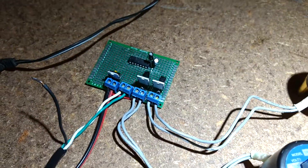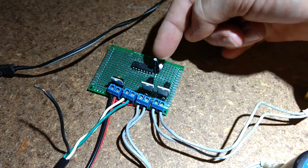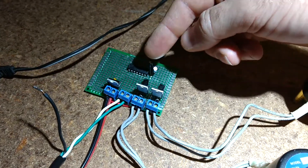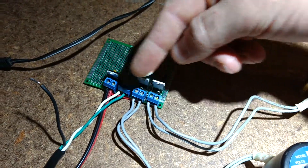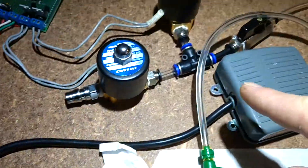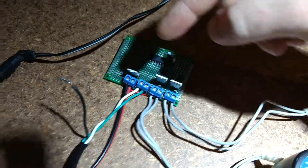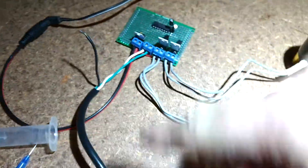The control circuitry is basically just a pulse generator — a negative edge pulse generator made out of some NAND gates or whatever — and a bunch of MOSFETs that drive the solenoids. I think that one is a 5 volt regulator for the logic, and we've just got 12 volts coming in here.